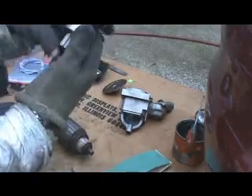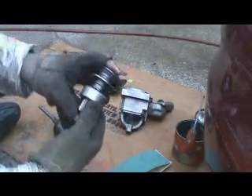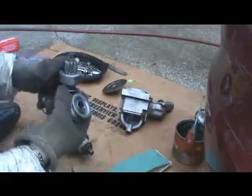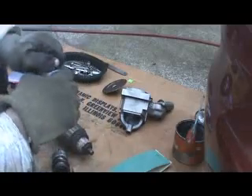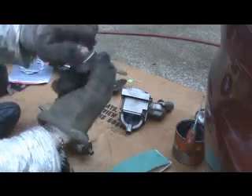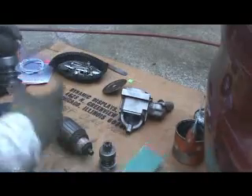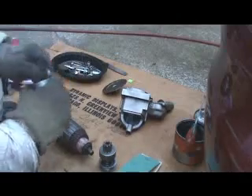The spring is quite a bit more difficult to compress on the new one. Something I've wondered about for years — is that all it is? A little spring wears out and you have to replace this whole piece rather than just the spring? There's something in here — it has a sprag in it, looks like a one-way directional sprag. This old one feels funny — I can turn it both directions, but the new one I can't.